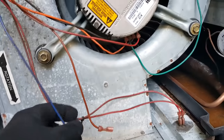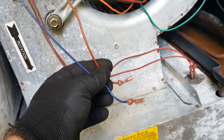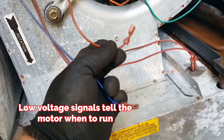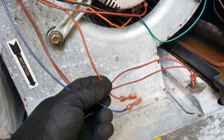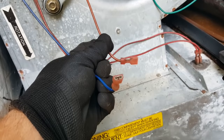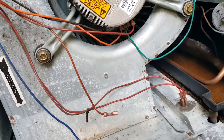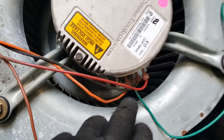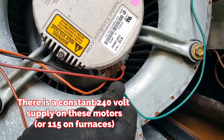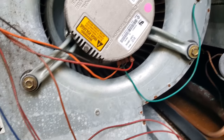What I have here are two wires — these are the low voltage wires feeding the ECM motor, telling it when to run. There's a common brown and a hot blue. There are two different wires, one for cooling and one for heating, because this is a gas unit. There's 24 volts coming in on this. The orange and black are the high voltage power wires, and the reds are heating speed low voltage, then we have our ground.